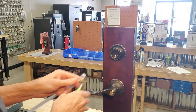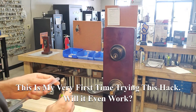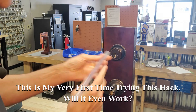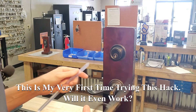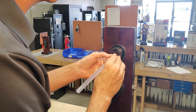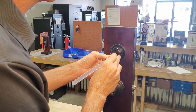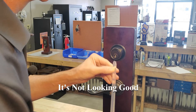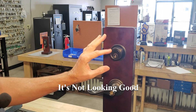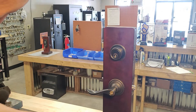What I'm going to try now is trim this a little bit on the side, because you really want to get that glue inside of that lock. I used my dykes to trim a little point on it and let's try it with that point — see if I can't get more glue in there. Still not enough. I'm not getting enough glue in this hole. This is one of our locksmith brand locks so it does have a really tight key tolerance on it, and with that lock I'm not able to get enough glue in that hole to grab it.